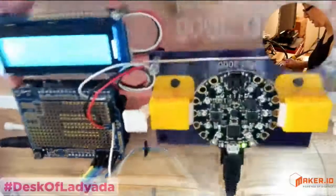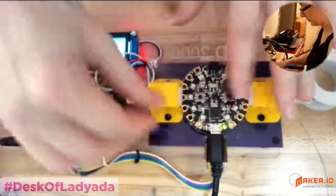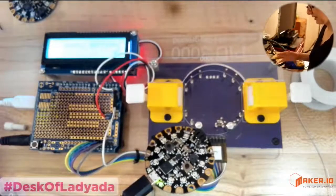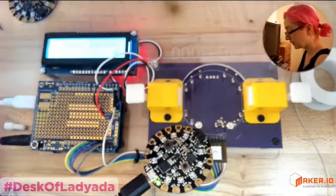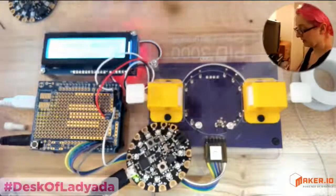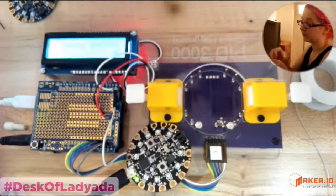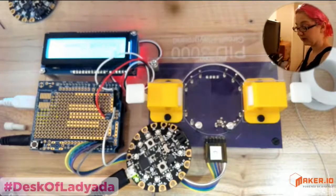Yeah, it's a little too warm in here, but normally it would go through the test procedure and it would program it with the blink sketch or whatever. So this is something that you should think about while you're doing your prototyping. Coming up with your test jigs at the same time will let you quickly build prototypes and program them. Very fast. I got tired of soldering the ISP on the back, and so I created a very generic version of this jig. You had to hold it up against the board, but it was good enough for me to get started programming the bootloader. So that's the bring up.